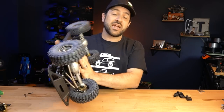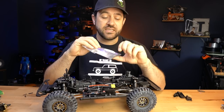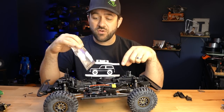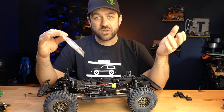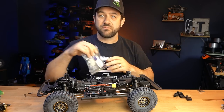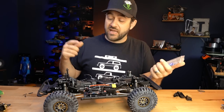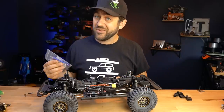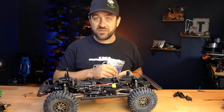So what I had actually done was purchased a thread repair kit. How you use one of these is you drill them out and then you tap the hole with the included drill bit and tap set. And then you thread in what's called a Helicoil, if you're more familiar with the brand name, but it gives you a nice threaded insert. I put those in a couple of spots and they held really well, nice and firm. So I feel actually pretty good about those locations.